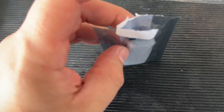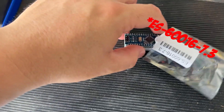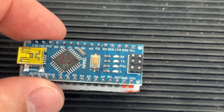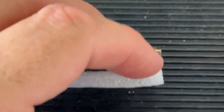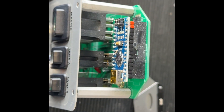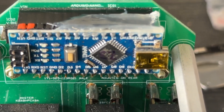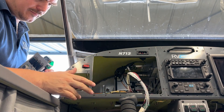We've removed the old Arduino Nano chip. Here's the new one — I'm calling it a chip, but it's actually a little circuit board. The new part number is ES16-7.3; you can order that from the Vans Aircraft store, but you do have to log in first to prove you're an RV-12 owner. Same size, same pins, same everything — just the firmware on that chip has been updated. The factory has painted an orange dot at pin one; make sure the orange dot is in the up position when you plug it in. Use as much hot glue as you want — the factory's picture shows a whole bead across the top.